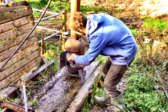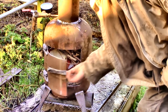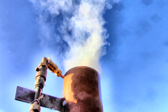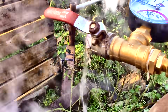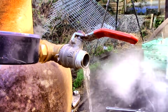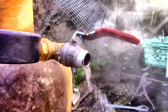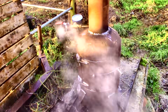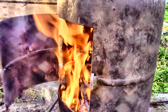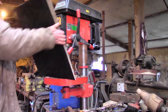This was my first attempt at a fresh steam boiler — it had some promise, but there was a lot wrong with it. For instance, the steam that came out was mixed with water, which is no good at all. So amongst other things, I need some sort of steam separator that separates the water from the steam. You'd think that was easy enough, wouldn't you — because the steam rises to the top of the water, so you just collect it from above. But there's a problem.